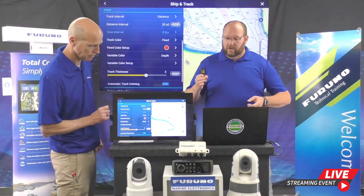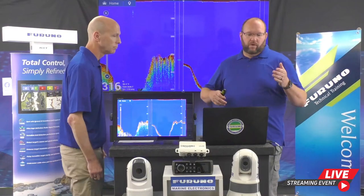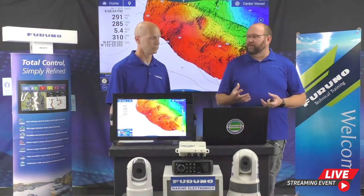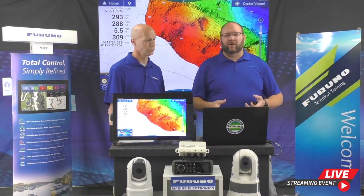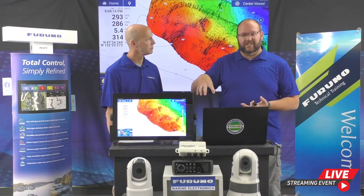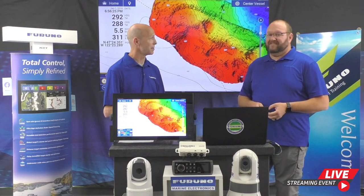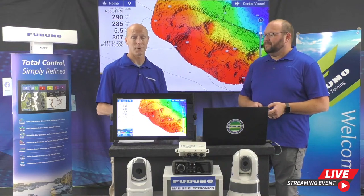Yeah. So as you're going to where you want to be, visibility is pretty important. On that note, our integration with FLIR has improved even more than it was before. Now with the smaller 232 cameras, we can park them. That was one important feature that I think required a JCU. It absolutely required a JCU. So now, rather than having that remote on the dash, you can keep it hidden or just not install one, and you can tell the camera to park. If you're on the water, it'll point the lens down, keeping it clean. If you're trailering a boat, it's more critical because you get stones flying up. And if you've never had to buy one, that lens is extremely expensive. So parking it is extremely important, which is why we always recommended the JCU before. But now with 201 software, you no longer need it.